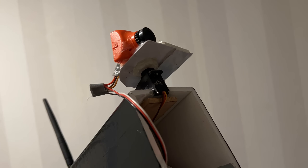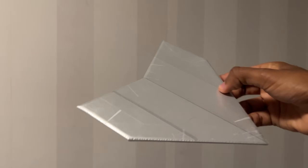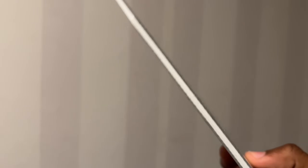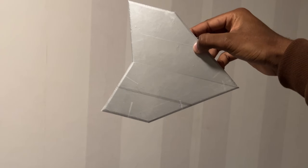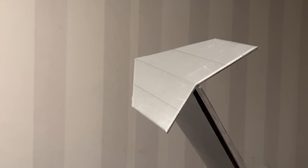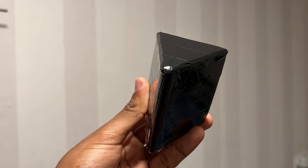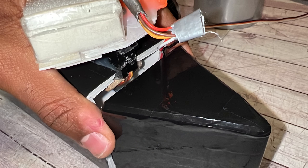Here is the camera device with the panning servo to look left and right, and the battery stop for preventing the battery from shifting forward. Here's the section of me constructing the winglets — aerodynamic devices that make your plane fly more efficiently by canceling out vortices, and also provide stability and aesthetics, as they are traditional on the V-tail pushers I make. The underside was trimmed down eventually because they were too big. At last, I made the nose section from a piece of foam board with the same height as the nose, created a triangle, glued it on a folded piece of foam board, covered it with black tape, and glued and taped it on the front section.